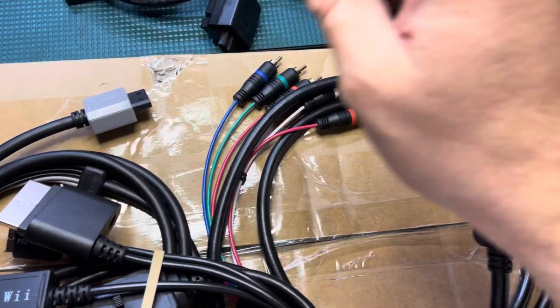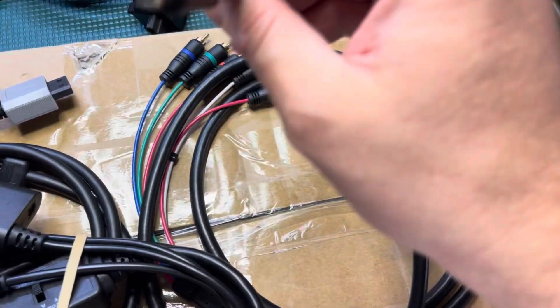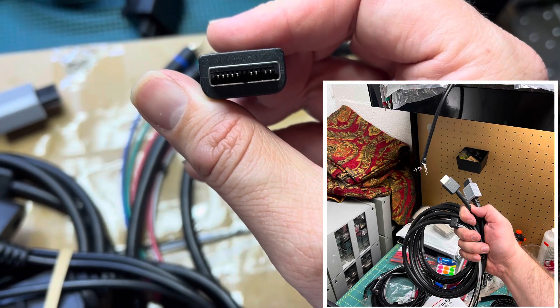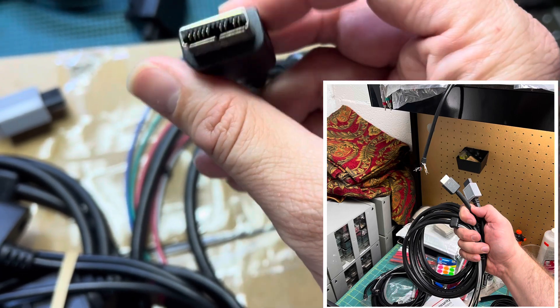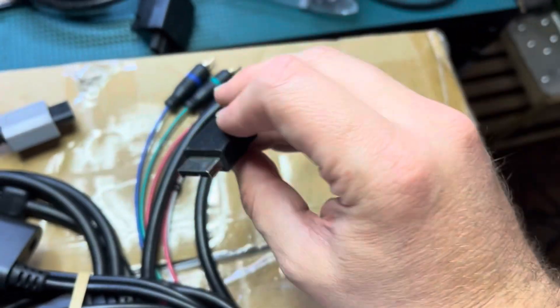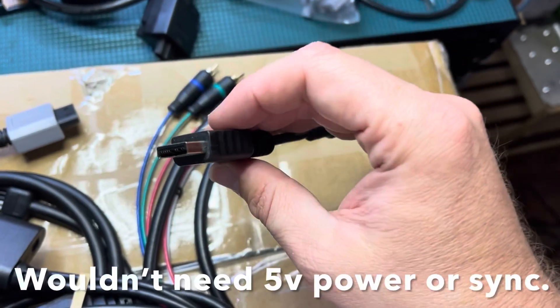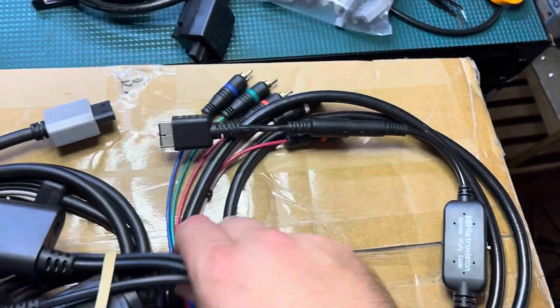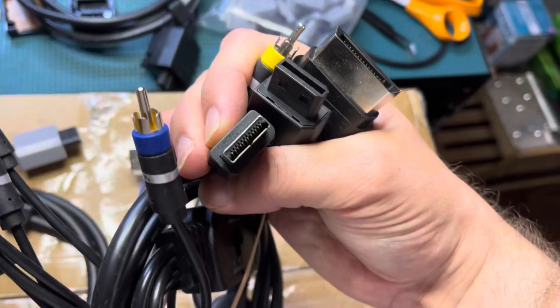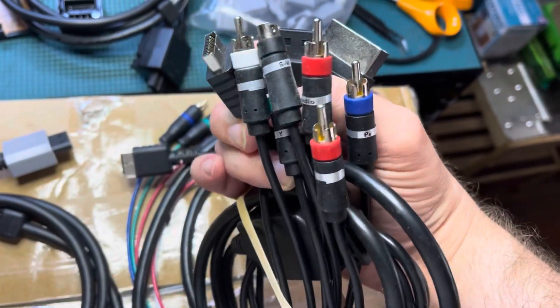I did make a PlayStation component cable out of those, even though these are my HD Retrovisions. You can see that they remove unused pins here, but this still needs sync. You can remove even more pins if you were building your own custom one to give it a lighter fit, because these are notoriously tight. The junk multi-system cables did not remove any of those extra pins, and it is the exact same connector — it's very common.